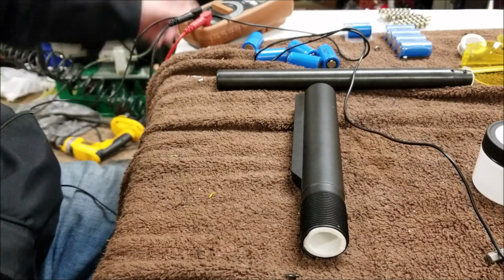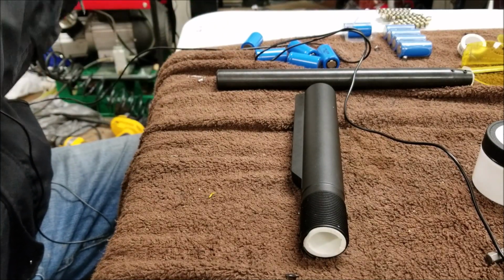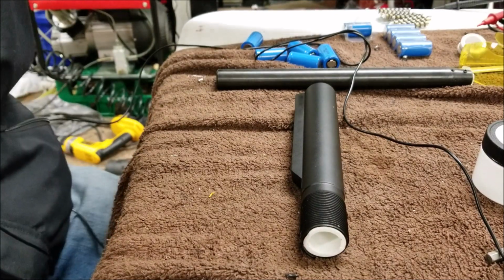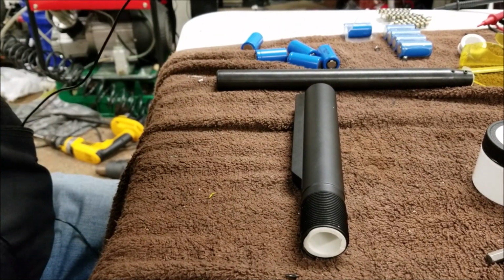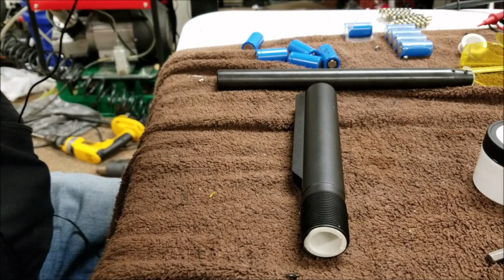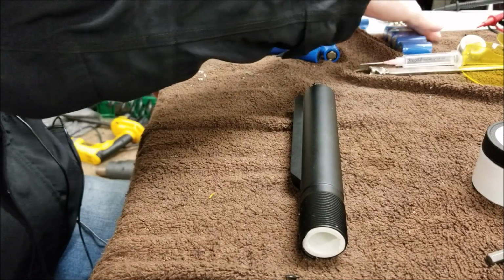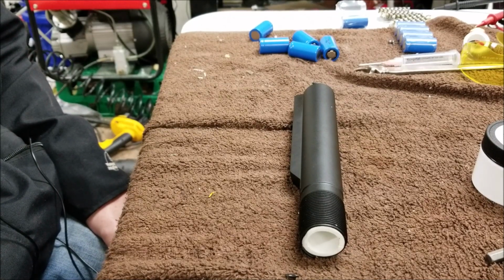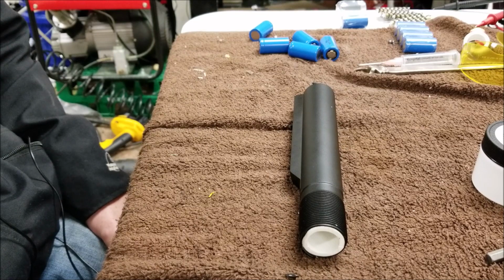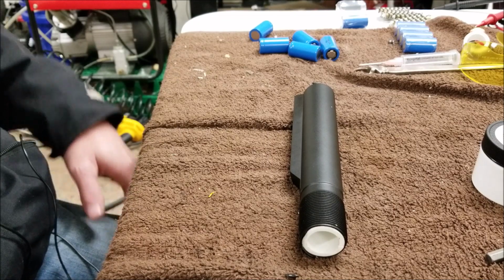And the last thing that I wanted to tell you guys that I was working on was for the new gun. If you've been following my channel for a long time, then you might know that I really don't like external battery packs. And I've always wanted to get away from that, but still have larger cells than 14500s because they just supply more amperage. What we're doing with the Superbird and the 14500s is, the best way I can think about it is we're compensating for the low amperage output with higher voltage, and that puts you right on the verge of destroying the main capacitor, actually both capacitors on Sergey's board.